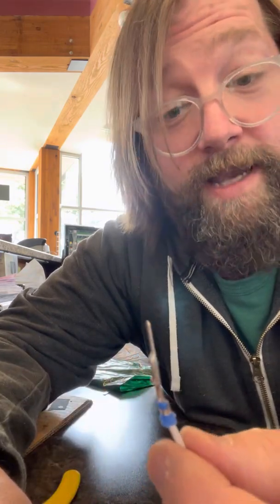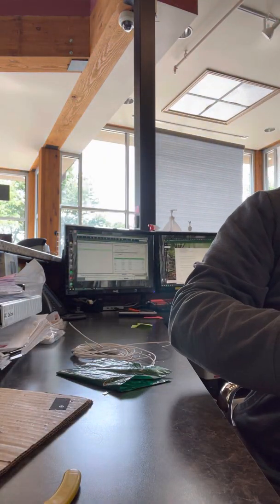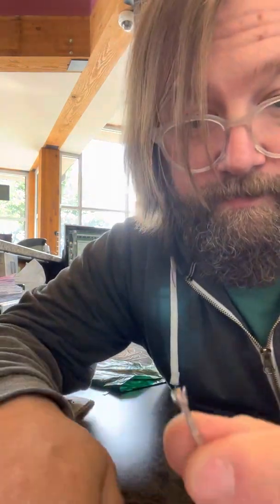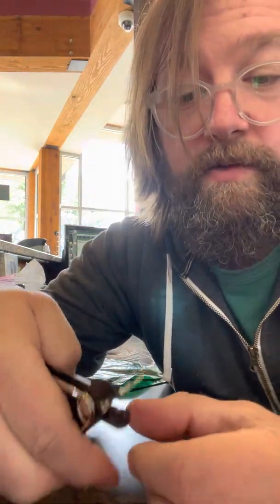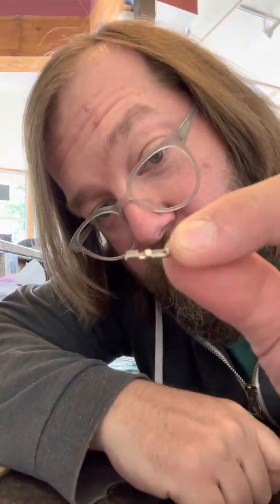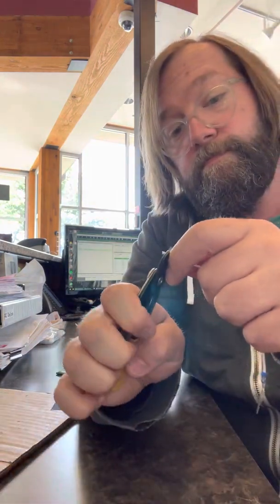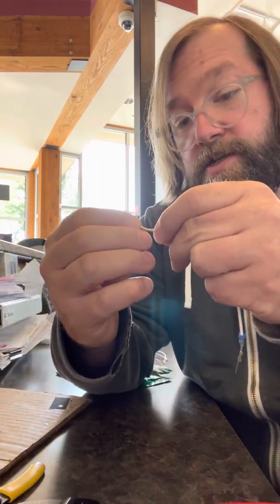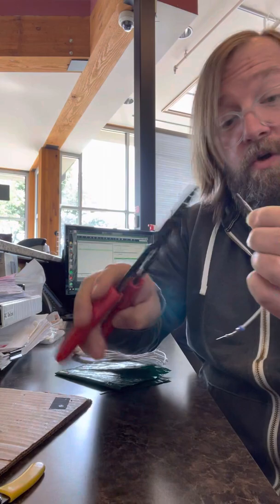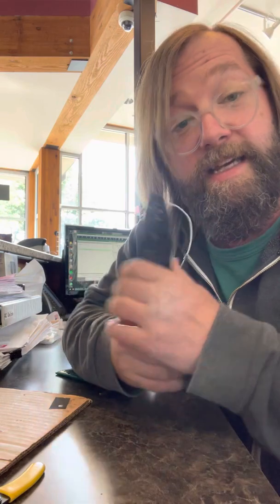So I mean, even if you want to try as a test, take the terminal, take a pair of side cutters, and remove that sealed section. So what I'm doing is I'm right in between the core crimp and the insulation crimp, and I'm removing that section of said terminal. And then what I can do then, strip them and try to just crimp that on without the sealed section and try to install it to see if it goes right in and pops right in. If it does, then you know that your rear crimp, the sealed crimp, is not small enough.